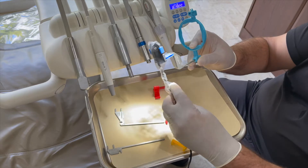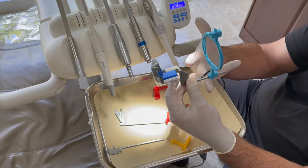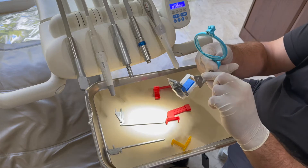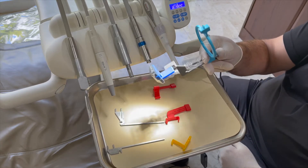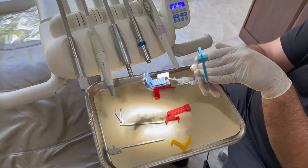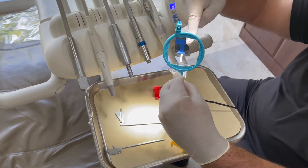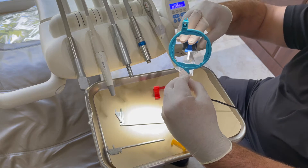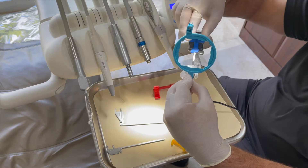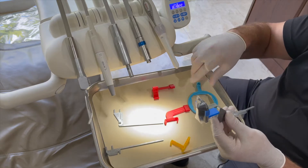I always like to grab my cable and twist it so there's no extra slack. I always use a syringe-type grip so I can hold the cable and bar and have very good stability. This also gives me the opportunity to see that my sensor is always centered along the ring. I want to make sure that my ring and my sensor are centered, because if I put my two teeth here they're going to be centered on the ring and my paralleling system will work correctly.